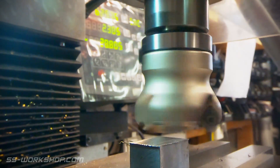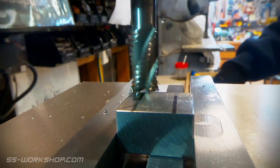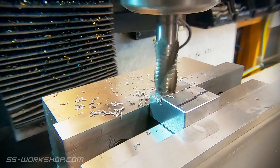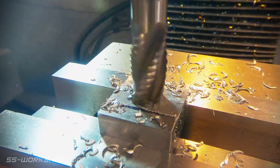With all the sides finished I switched to a roughing end mill. I now removed the excess material from the clamping feature, which consists of two steps: one that fits in the slot of the toolmaker's vise and the other a relief to allow for the clamping.